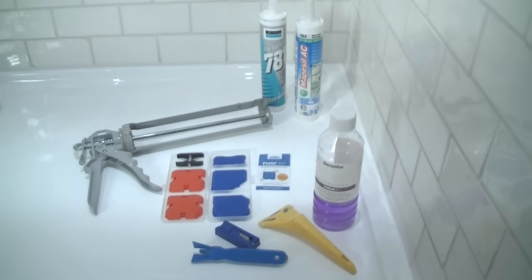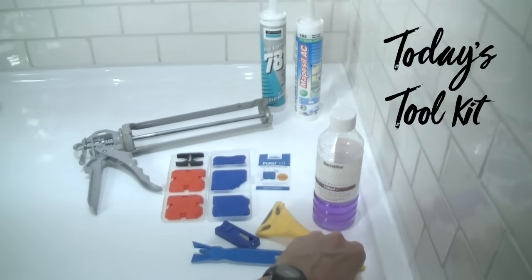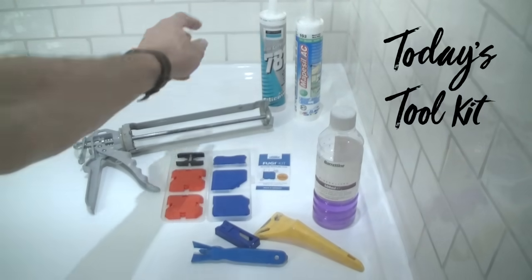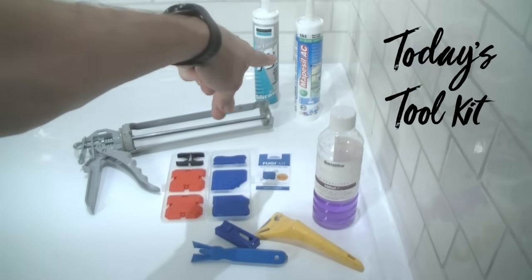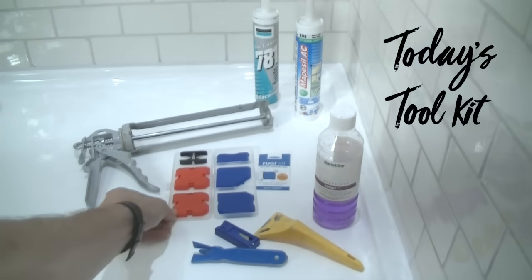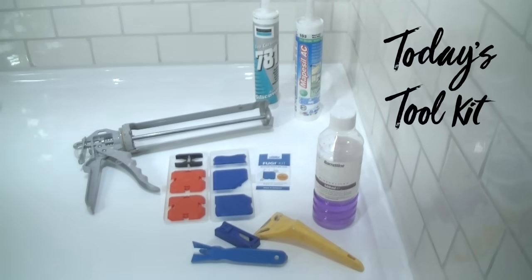So let's have a look at the tools featured in today's video. We've got this Everbuild Sealant strip out tool, and we've got a Stanley knife and a scraper here. And to degrease the joint we've got some methylated spirits. We've then got the silicone applicator gun here, two different forms of silicone, clear silicone 781 from Dow Corning and Mapesil, which is a coloured silicone available in lots of different colours. Great when you're trying to match the silicone to the grout. And last but not least, the most important thing in the kit is the Fujikit silicone profiling tool from Kramer. Full details of all today's tools will be available in the description at the end of the video.